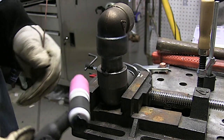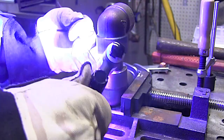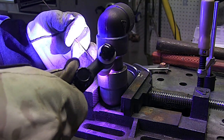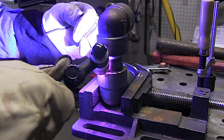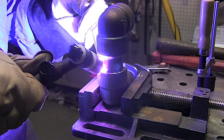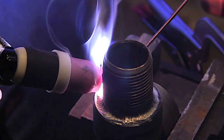I'm starting off at 120 amps, but I found that wasn't quite to my liking, so I went up to about 133 amps for these joints. 120 would do the job, just a little slower — I just liked it better at 133. For the first pass I'm using 3/32nd filler wire, a 2.4mm filler wire, same size electrode, and just a little bit of a wiggle.